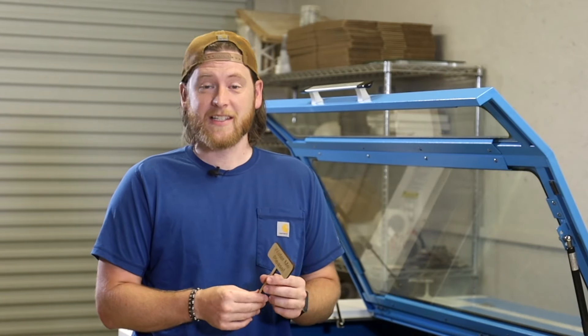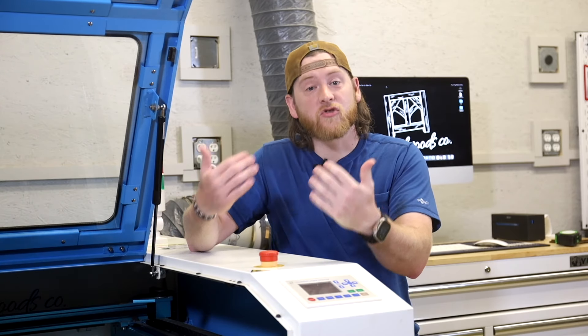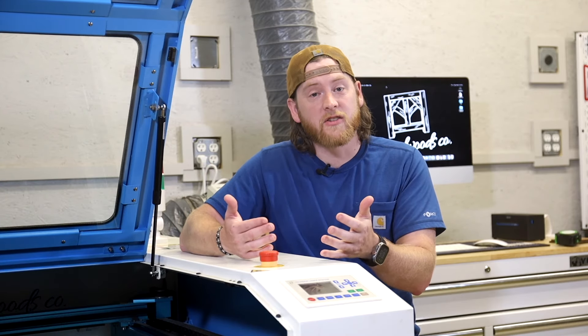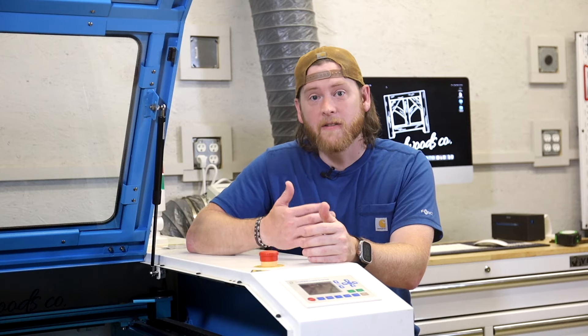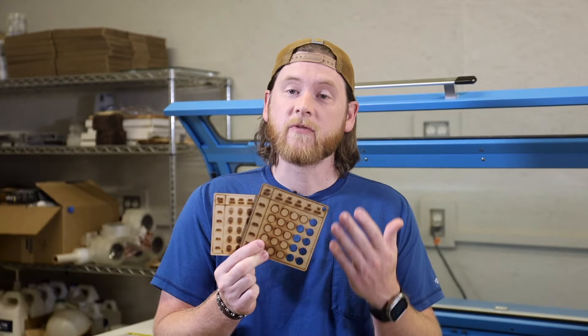Now that we have our project, it's time to understand how a laser works. A laser is all based on power and speed. If I blast the laser at high power, it doesn't take long for the laser to cut through something, so I can start moving quickly. The lower the power of the laser, the longer it takes to cut through, so I have to move slower. Higher power means I can move faster. The same applies for engraving — I apply power but don't want to cut all the way through, so I reduce my power and speed up the motion very fast. Each material you put in the laser will cut or engrave at different settings because of the density and material. There are test files you can run on all lasers to fine-tune your favorite settings for the material you're cutting.